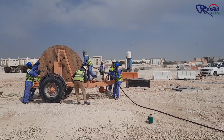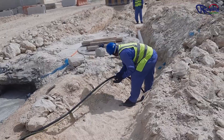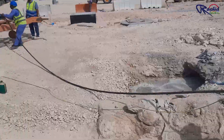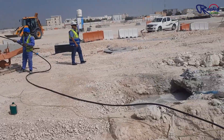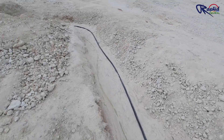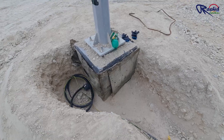Now cable pulling has started. Here we do not need a winch machine for pulling the cable, because each cable length is around 40 to 60 meters — that is the pull-to-pull length. Because the cable length is short, with the help of people we can pull the cable. Once the cable is laid completely, during laying, some stones may fall into the trench. We need to remove all stones, otherwise they will damage the cable insulation.